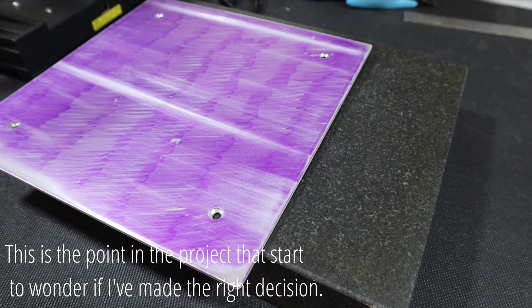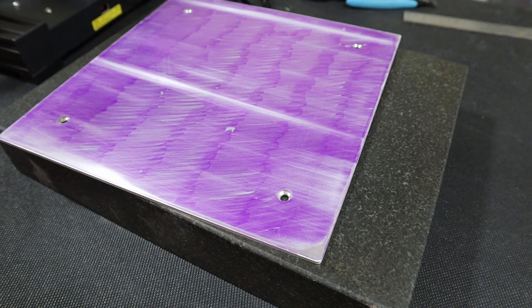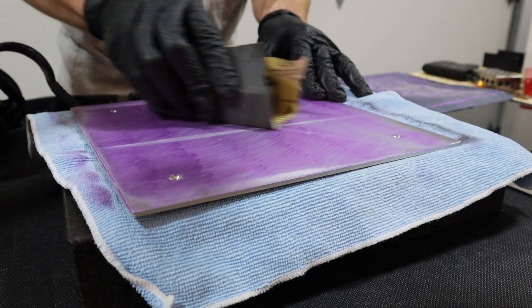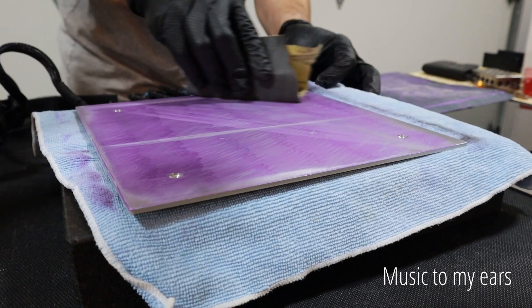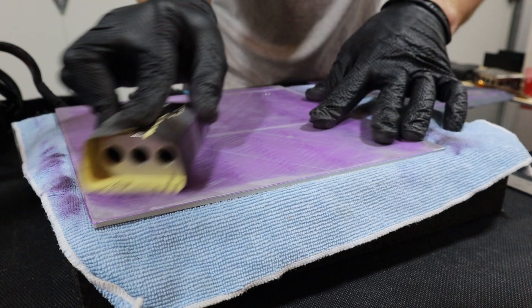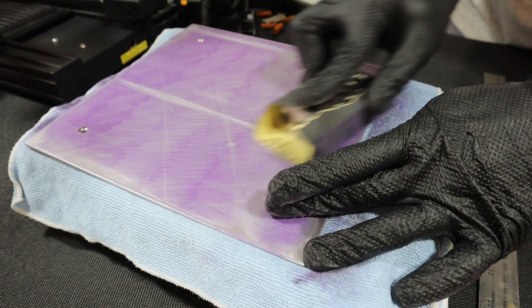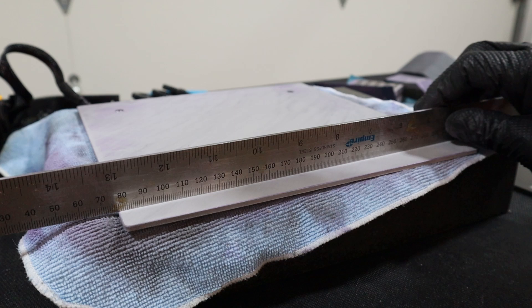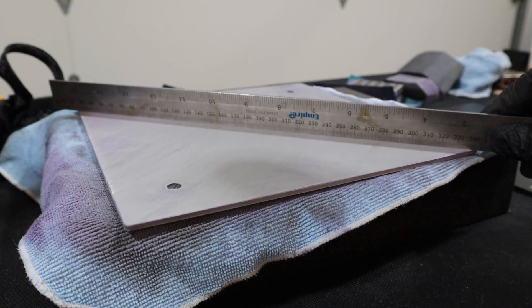My aluminum plate is not very flat. The two front corners seem to be raised quite a bit, with the right one being far more than the left, and the rest seems to be pretty well alright. I realize I don't have the best setup for sanding — ideally a piece of 400 grit adhered to a flat plate would be perfect — but I'll just make do with what I have and keep checking as I go. I've placed doubled-up cloths below for support to prevent damage to the heating mat. This has taken a little while but I've managed to get it flattened using my 1-2-3 blocks, sanding diagonally in both directions and checking as I went. That worked pretty well.